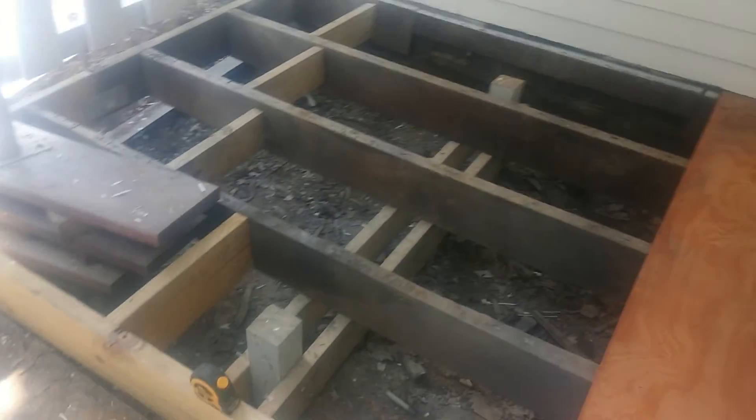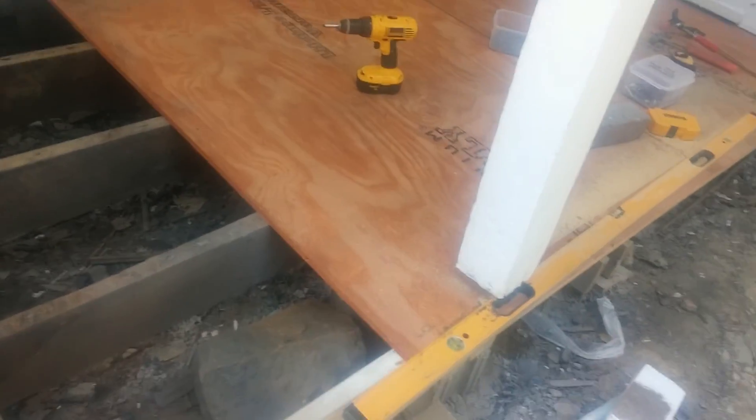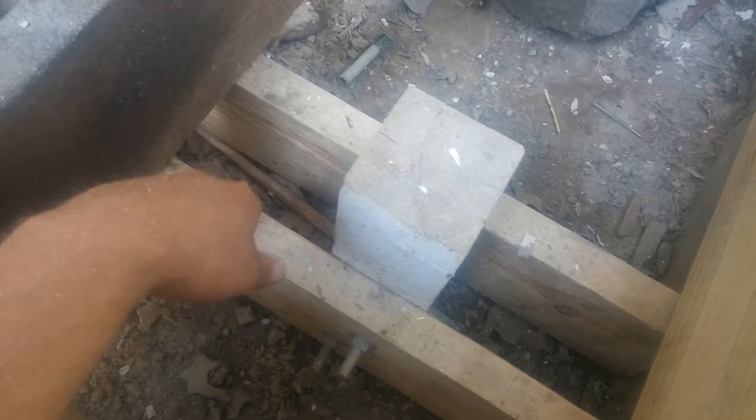Construction update. This is what's going on. I'm just putting some redo in the deck. All the joists were sagging so we did this kind of system. I dug down about four feet on one side and only two on the other because it hits stone.